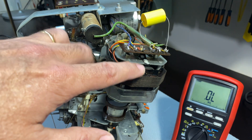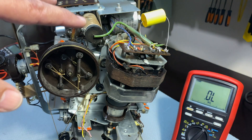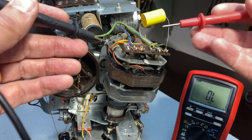The phasing on them is critical — very important — the way they're wired. They've each got a red and a yellow wire coming out, which indicates the phase, and what we basically need to do is check for continuity in each of those. I'm calling this one, two, three, four, five, six, and I've already done a drawing — I'll show you the result.